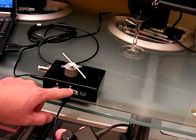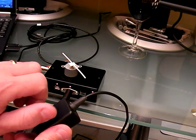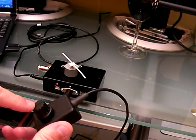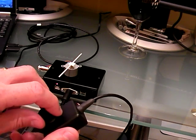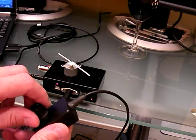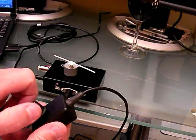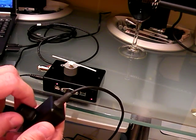If I hit the center button, the LED comes on indicating we've gone into rate change mode. If I turn this about three turns anti-clockwise then back into normal focus mode, notice that the step size on the motor is now significantly larger. This is all fairly arbitrary and can be changed in software once it's on the scope. So that's manual mode — it can be used whether or not it's connected to the PC, or both.